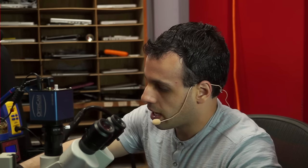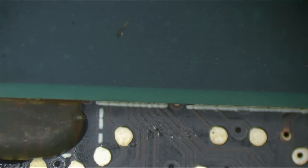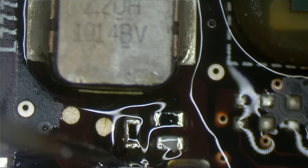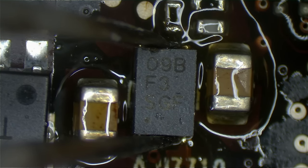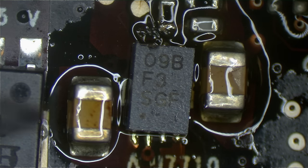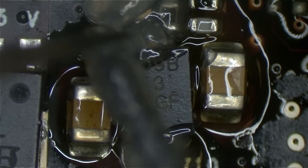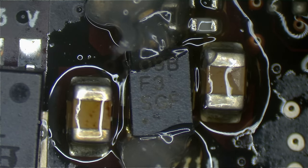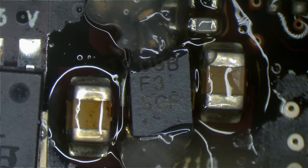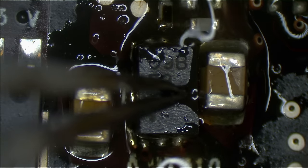I can only guess what happened based on hints, and what I see here, it looks like that has been replaced before. So, what I'm guessing is that the one that was replaced failed. I can't know exactly why, but I have to keep in mind that maybe the chip is just very sensitive to heat. So perhaps when the first individual replaced that chip, they used a little bit too much heat. I can only guess, right? I don't know if that's right, but it doesn't hurt to think about it.